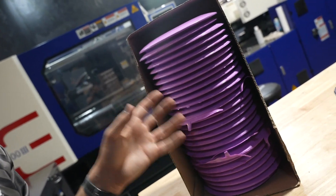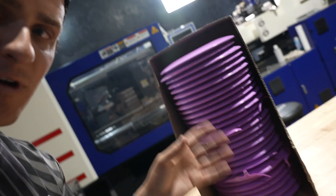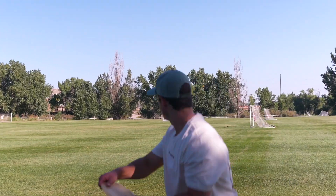Quick interjection — it actually goes a bit further than just waiting for a full table. Once the disc comes out, it's super hot, you let it cool on a table, and then you still have to let it set for another 24 hours. Because what the discs look like after 24 hours can still change. We've seen discs looking great on day one but being warped on day two. So through the whole test we're taking notes and gathering data, but the full conclusions will come towards the end of the video when I threw the discs after 36 hours.